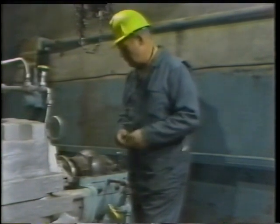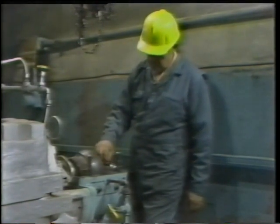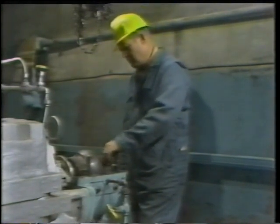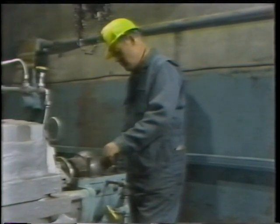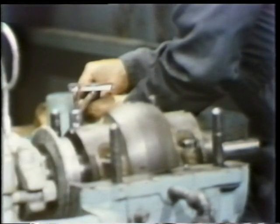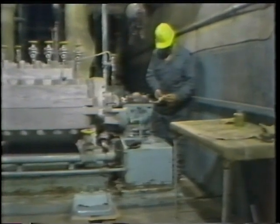The bolts have to be torqued, and resistance in the threads could result in unreliable torque readings. That could result in damage to the journal bearing or the thrust bearing. So he continues to thread the bolts in by hand until they're both seated. Then he performs a final tightening with a torque wrench. The bearing is fully reassembled at this point.